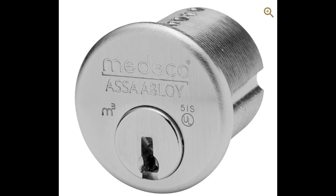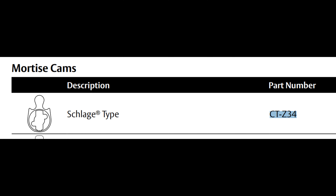In the device for the lever there is no hole. This is for the lock — either above the device handle or on the back side of it. Do you know the model number of the lock? Yes. The mortise office entry lock is L9050L. I see — you have a mortise lock. On those doors that take keys, there will need to be an inch and a quarter diameter hole drilled into the door itself. Is that hole already drilled, and is the inch-and-a-quarter hole completely open? It's completely open.